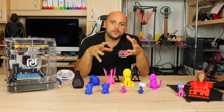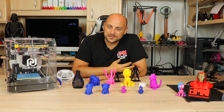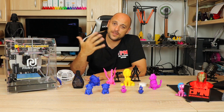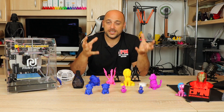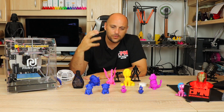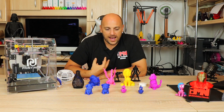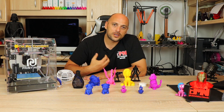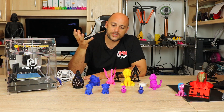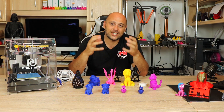Initially I did quite a few prints — you can see those in my initial thoughts video on the Colido Compact — and it was a bit unimpressive. The fact that it doesn't have a part cooling fan makes it difficult to print in PLA, and without a heat bed this printer is aimed at printing with just PLA. When you're printing with PLA, you need a part cooling fan because the plastic needs to cool down after it's laid down in order to hold its structure intact. My initial prints were disappointing because they had a lot of sagging.